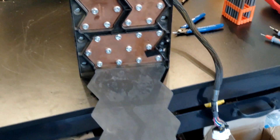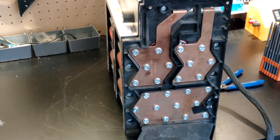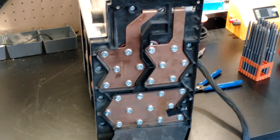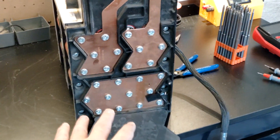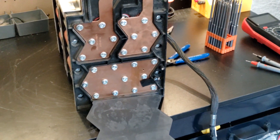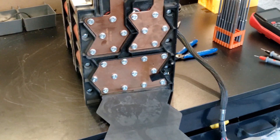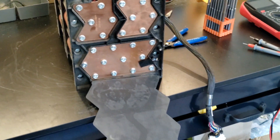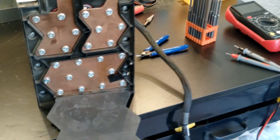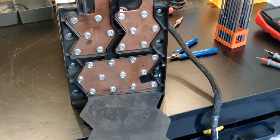But we're going to. We're going to take this plate off, cut it down the middle, and then we'll show you that they're two separate sections. If you want to run 12 volt, you can. The biggest reason you might want to split it up is if you want to run it in parallel — so you could run 12 volts at 96 amp hours instead of the 48 you get with just the way it is. So let's go ahead and take off this plate, mark where we can, get our Dremel out, and cut it in half.